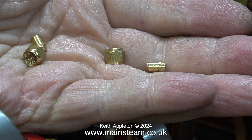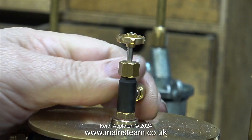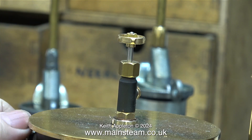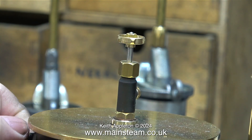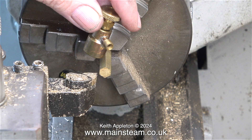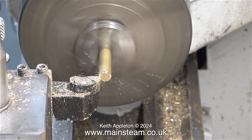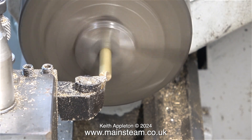What I'm going to do is remove all of the existing pipe union fittings and make some special brass adapter fittings to take the silicone rubber tubing. You can push the silicone rubber tubing directly onto the threads, but where gas is concerned it's better to make sure that you get a good seal. This is the gas canister adapter which actually leaked when I fitted silicone rubber tubing directly to the thread. What I should do really is spend ages making a whole collection of adapters for silicone rubber tubing, just like I have boiler plug adapters.